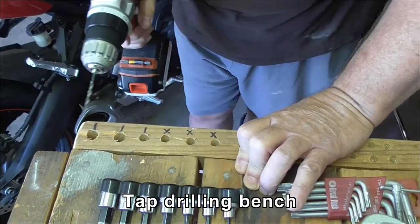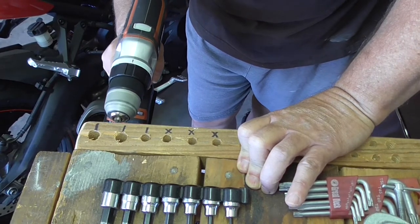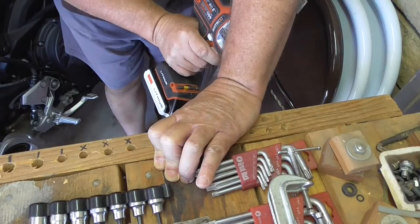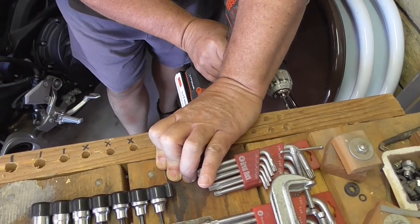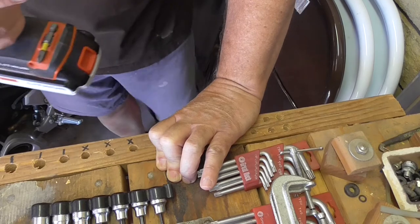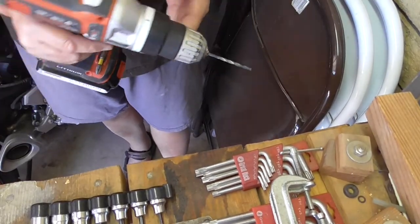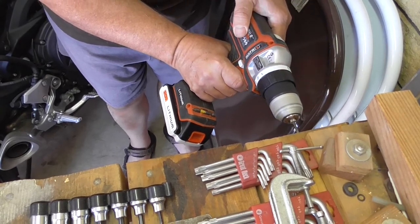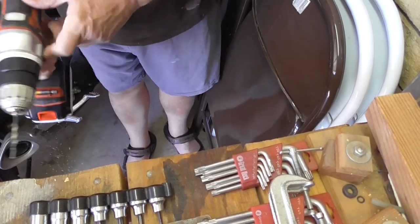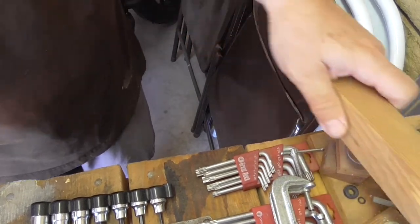The picture looks upside down now but I am not working in space. I'm drilling through the hole I've already drilled, then I'm going to drill the other one on this side. I'll take the piece of wood off and finish tap drilling because this drill is not three inches deep — I need to go deeper into the wood. Same on this side. I'm ready to put a clearance hole in this piece of wood and go to the full-size clearance hole.